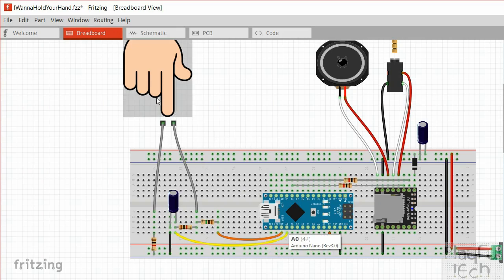Now let's suppose that we do have a connection here that is going between one or more people and closing a circuit. Well, now if we look through the circuit again, when we get to this point here, what we've done is we've created a voltage divider, because there's actually two routes now through the circuit. There's the one that we had already, but we also have this one that comes up this way across the conductive skin surface and back down through this 1 kiloohm resistor and back down.